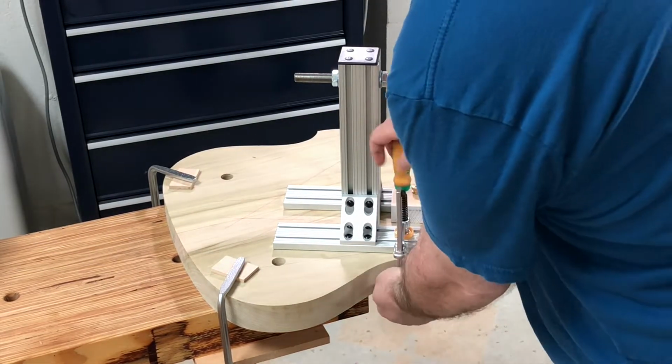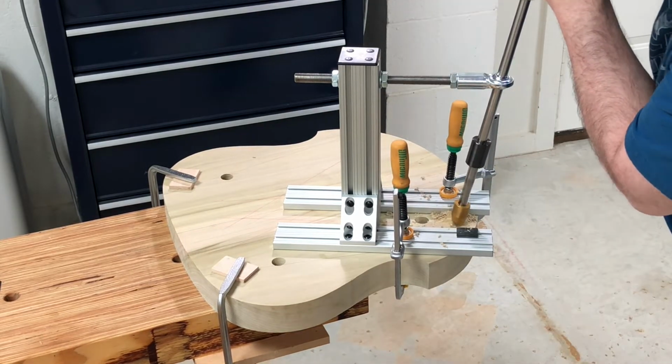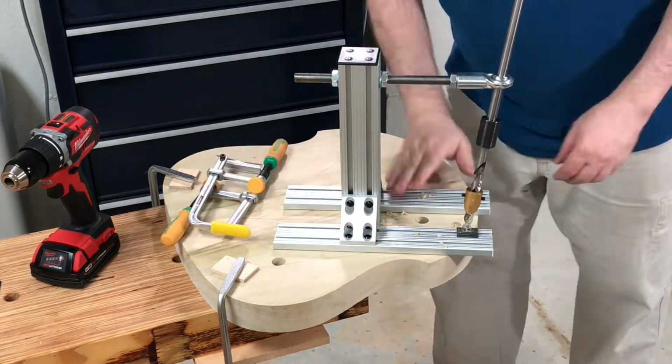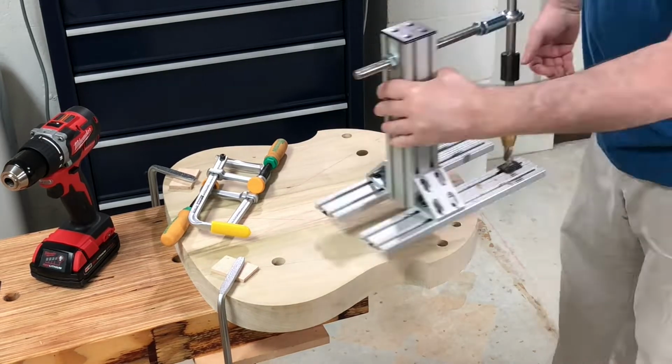So next up, here we are drilling the spindle mortises. First up is, I guess you would call it, the number 4 mortise, and this one is at 11.5 degrees. Again, I'm using the stop collar there, you can see on this 1/2-inch bit, and that stop collar again is by Sean Murphy.